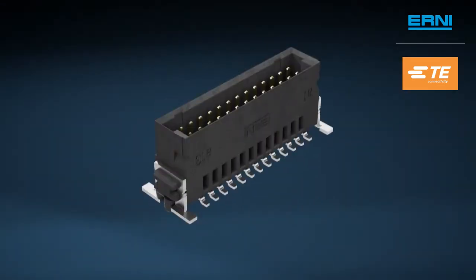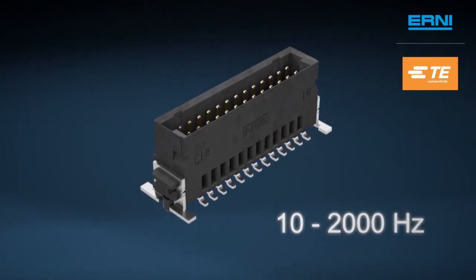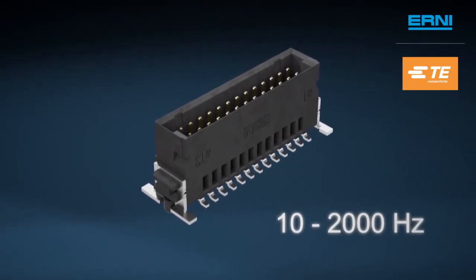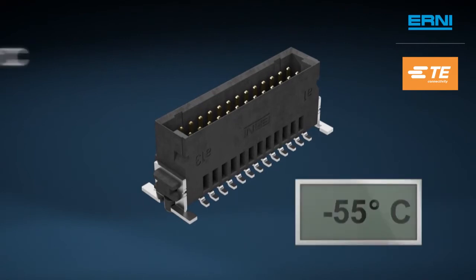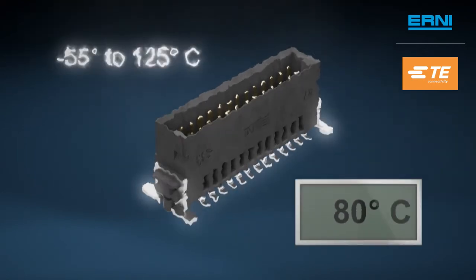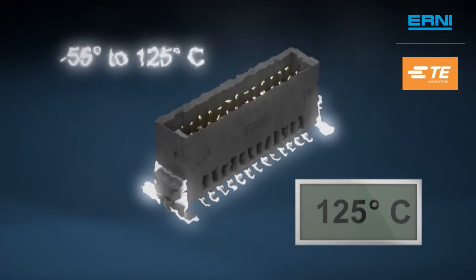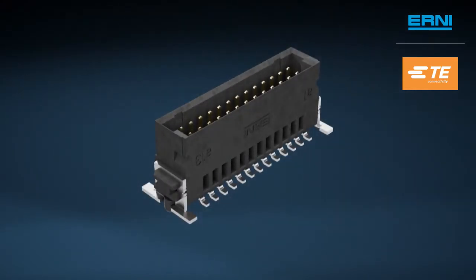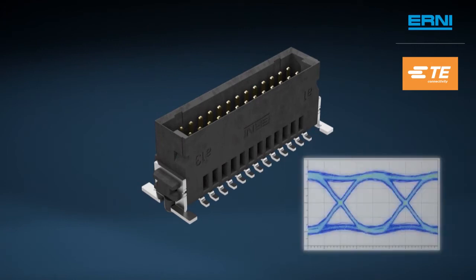The SMC connector resists high shock and vibration forces for a safer application in a rough environment. It also resists temperatures from -55 degrees Celsius up to 125 degrees Celsius in its final use. Through its elegant design, the SMC connector also has high-speed capabilities up to 3 gigabits per second.